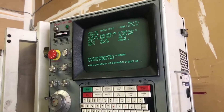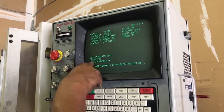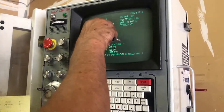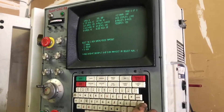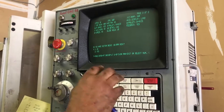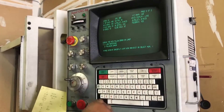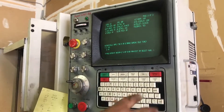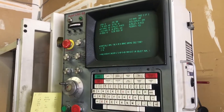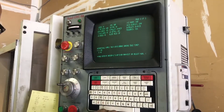Timers are off for right now. Overloads — it says it'll have two counts of overload before it logs an error. Screw type is two — actually it's one, they're inch ball screws. Inches per minute is 400 — that's maximum with an inch screw. Z-tap gain is normal, one. Vector is no — it does not have a vector. Axis display is load — it's actually following error. On a DC machine it still displays as following, but to keep everything right it needs to be set to load.